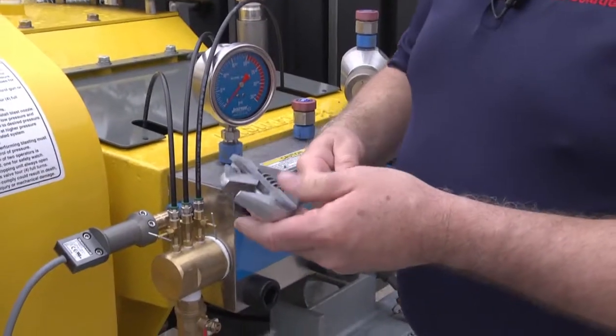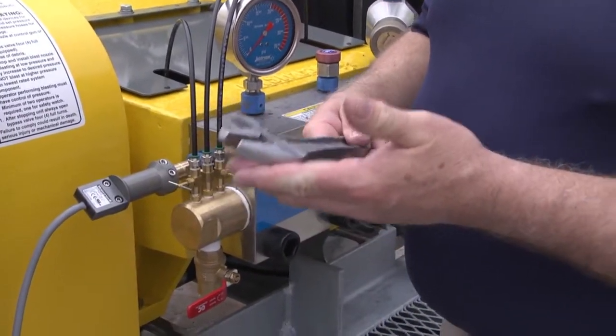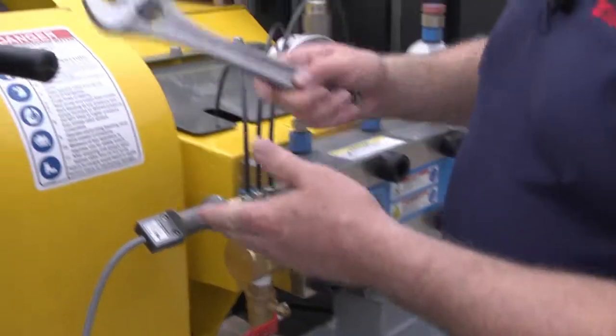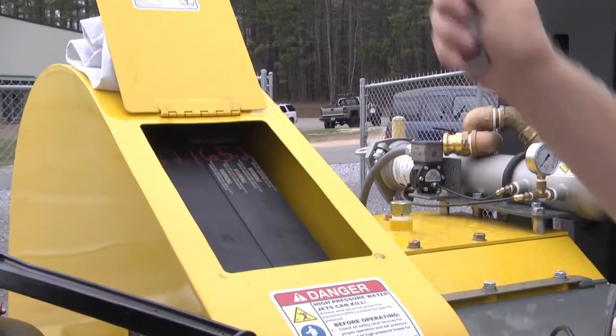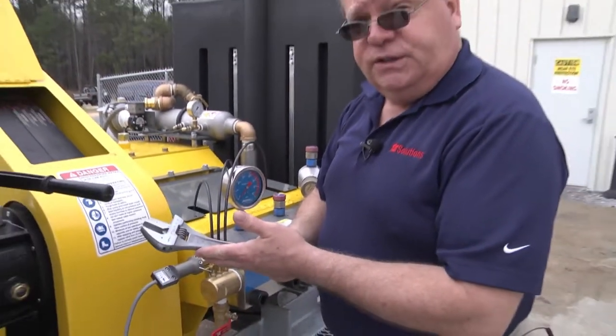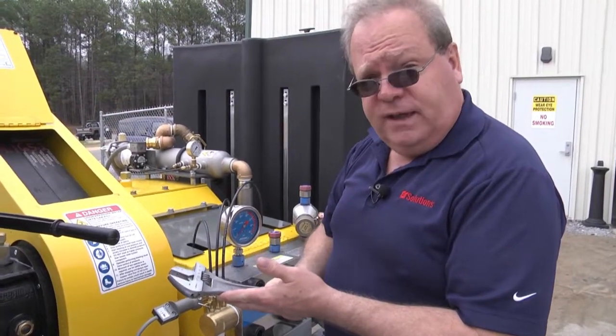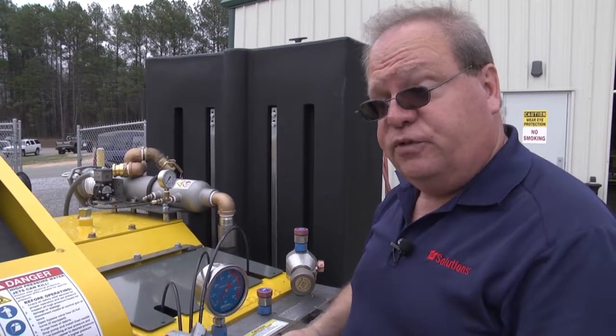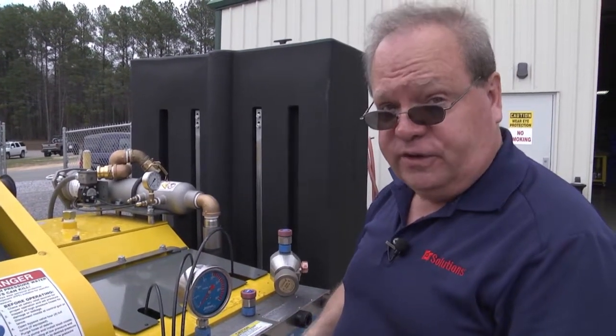Finally, in the field, I tell people just check your tension the way a tractor trailer driver checks his inside tandem wheels. Hit the belts with the backside of an adjustable wrench and make sure you have a good ring and a good bounce back. That is generally sufficient to ensure that your belts are in good condition for the job.